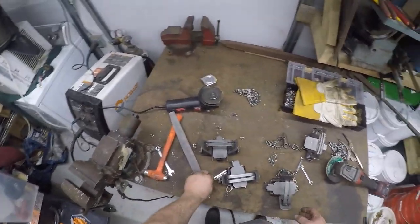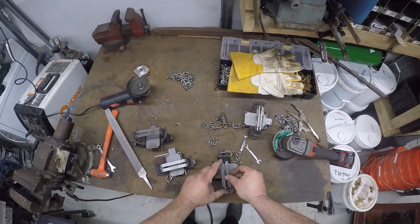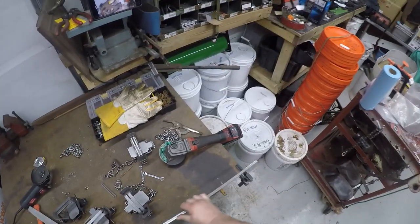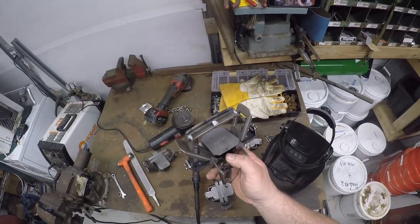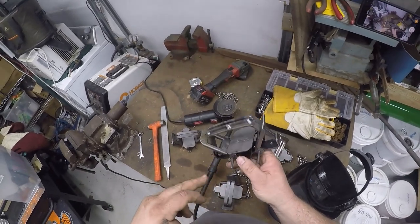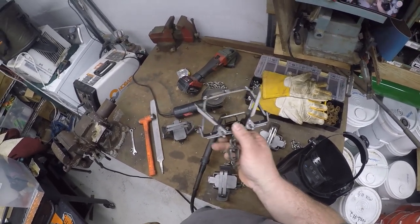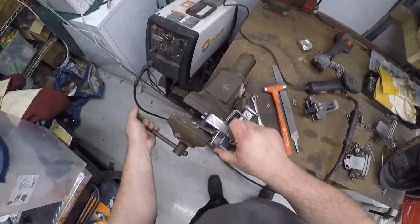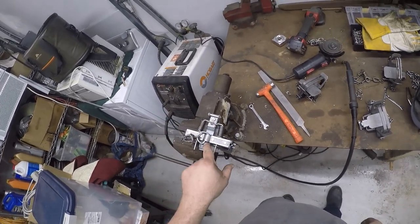So the next thing we're going to do is we've got these little, I prefer a square stock, 3/16 square. We'll weld them on. First, we got to cut a couple. So there, got our clamp on the table and our mark where it goes. Okay, now got the laminations welded on. The next thing we did was put a little dab of a weld on the end of our jaws just to give them a little extra strength. Next thing we'll do is flip the trap over, put it back in the vise. We'll weld each end of the base plate and both sides of the main frame.